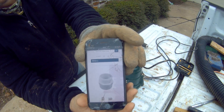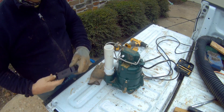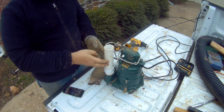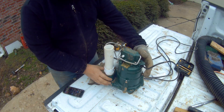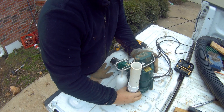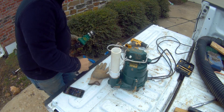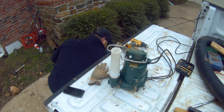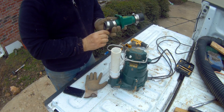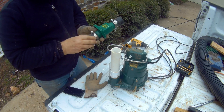For those of you who are not sure, simply pen-type that in there. Then I cut my riser. Make sure when you cut your riser that you give yourself clearance from the float bar right here — you need at least a quarter inch clearance so that you can slip your check valve onto your riser.